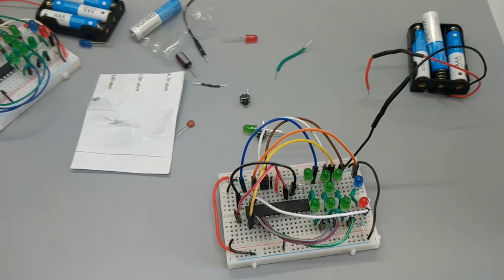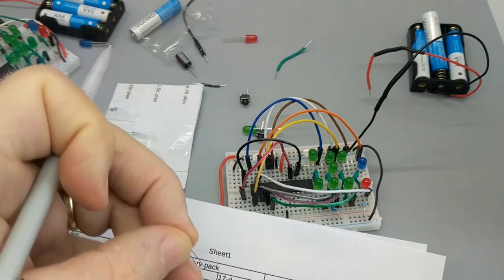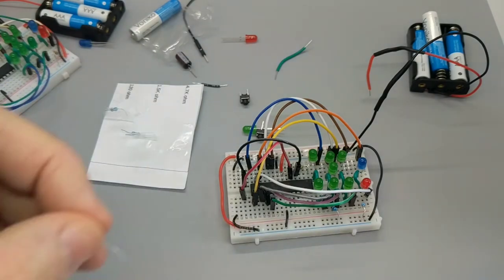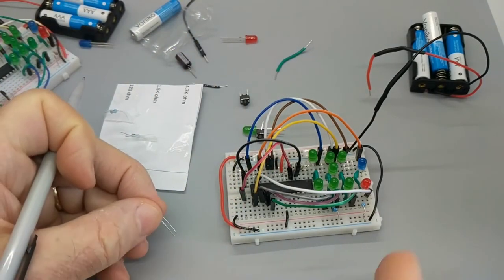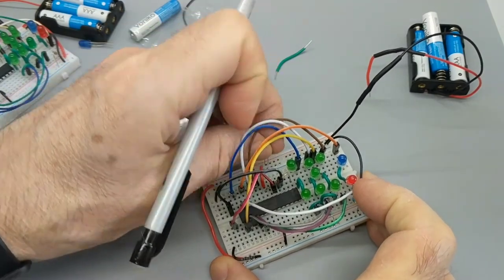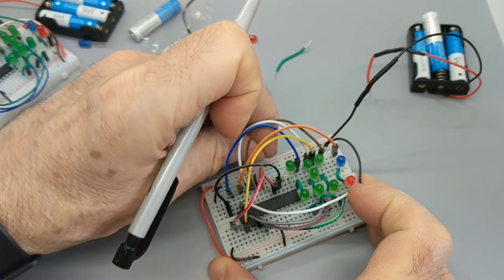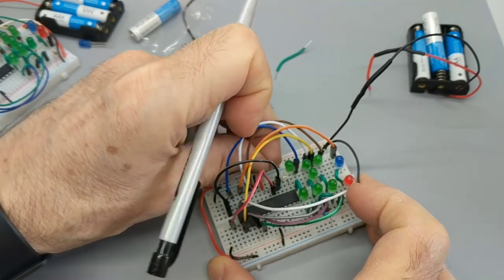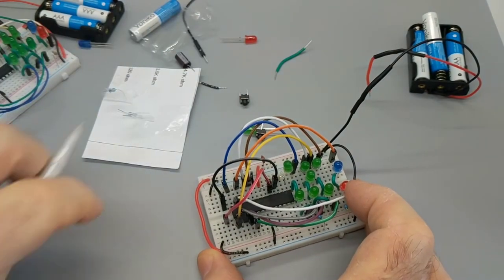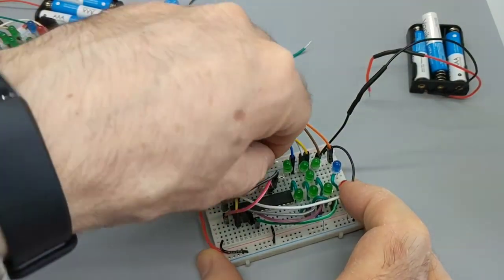All right, now, the next is a disc capacitor, which is this thing, near the negative and positive rails, near the short red wires. So that's this one here. Technically, I can actually put it in here, but you want to go from the negative rail to the positive rail. There. You know what? This thing is a little bit of a protective capacitor.